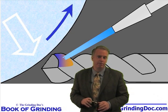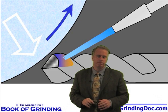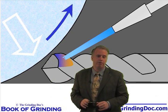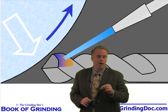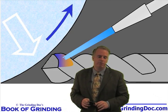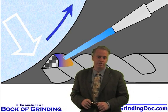We prevent it, or at least retard it, from forming that oxide layer. Here's a very typical example: point grinding on a drill, but really it could be anything. Don't mess around with your main arc of cut cooling — have a good cooling velocity there — but put an extra separate coolant nozzle aimed right at the oxidizing region, cool that oxidizing region, starve it of oxygen, and you'll find that your oxidation burn is eliminated, or at least reduced drastically.